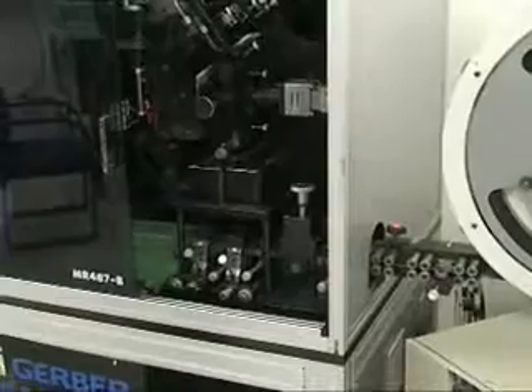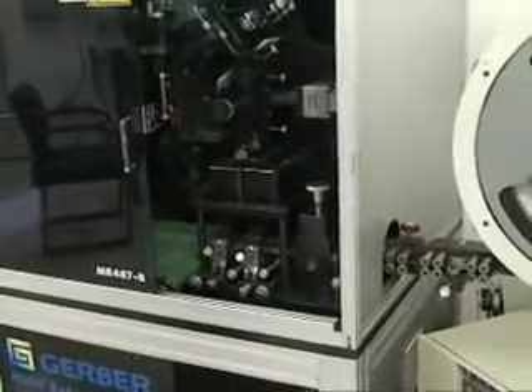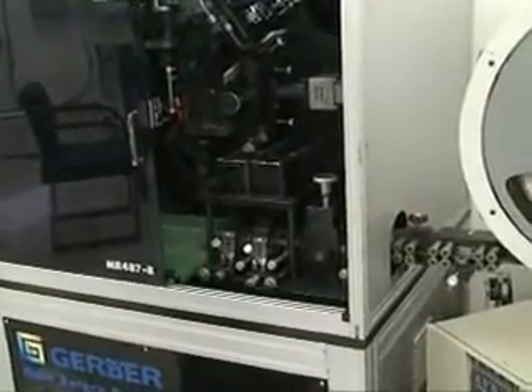Cut, miter, bridge and mark bends for straight rule. It will also process the four-point crease. A lot of guys are doing two machines. If they have a regular bender, as you guys do, you're processing the straight rule on a straight rule machine, and then they primarily use this straight rule processor for their creasing rule.